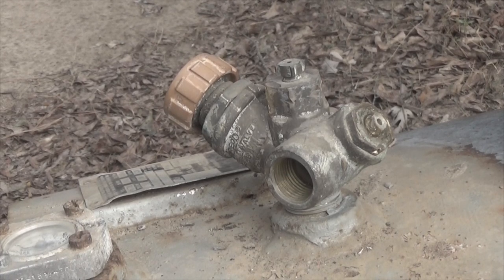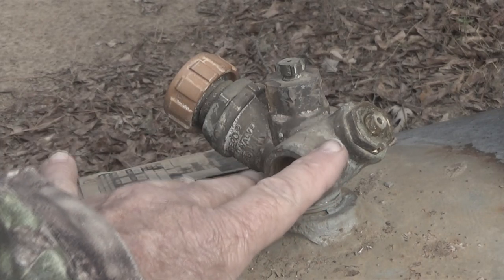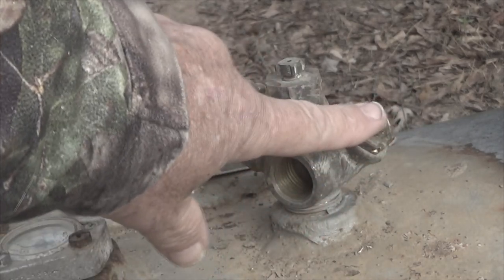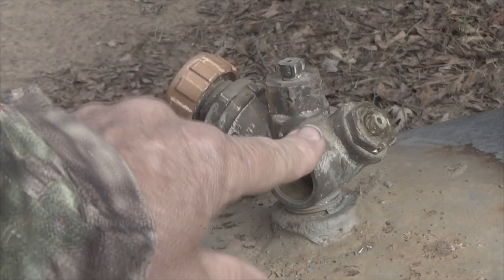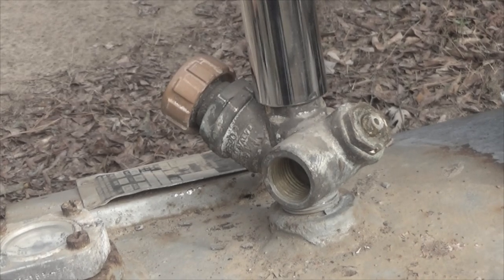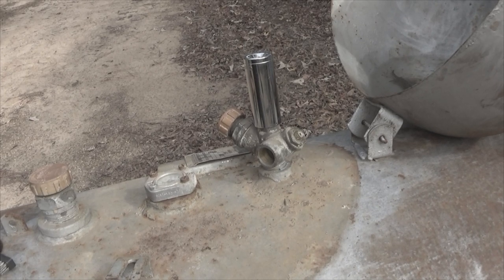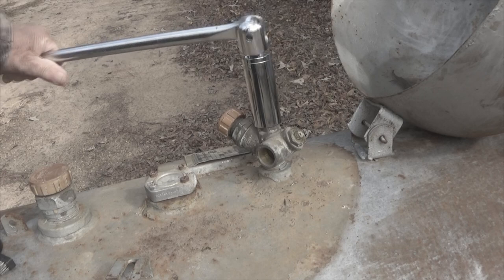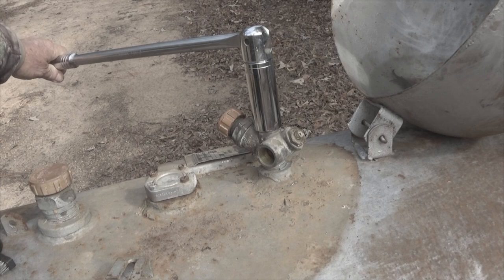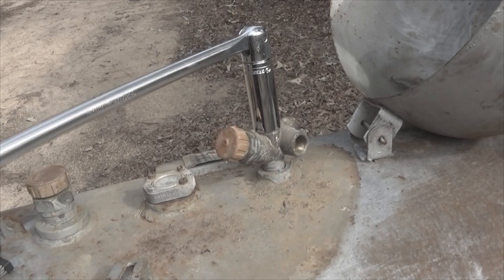I bought this tank, and this valve right up here, which is a 7556V, has gone bad. The shutoff valve is broken off and needs to be replaced. That is accomplished by putting a one-inch socket on it, taking a handle, putting it down inside. I broke this free yesterday using a three-foot cheater, and now you turn this by hand.